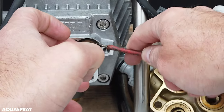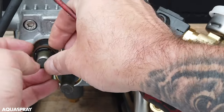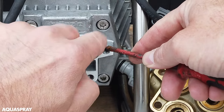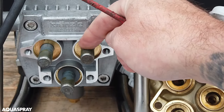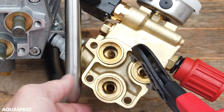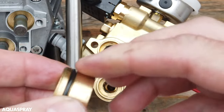Normally when you do this you'll see that the seals are caught on the piston when they should be in the housing. Gently remove them — if you're replacing the complete seal kit you don't have to be as gentle. If you're using a screwdriver, be really really gentle; if you scratch the piston or the housing it's going to leak. This is where your pump pliers come in, and if you crush the seals you will need to replace them. The idea is to rock them backwards and forwards and up and down until they just pop out.